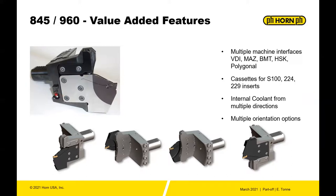The cassettes are ambidextrous — they can be configured right- or left-hand, which is handy depending on whether you're running upside down or right side up, or on a main spindle or a sub-spindle. You have adjustment of cutting height, and internal coolant with multiple coolant options. You can run the cassette right side up for the main spindle, upside down for the sub-spindle, or flipped to the other side of the basic holder in either orientation — all with the same exact tooling, simply reconfigured.